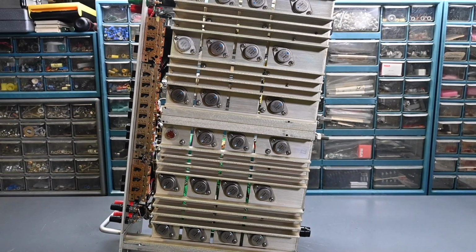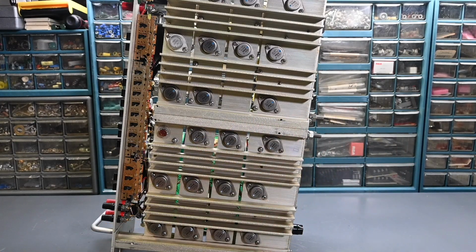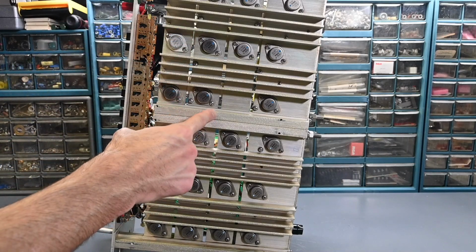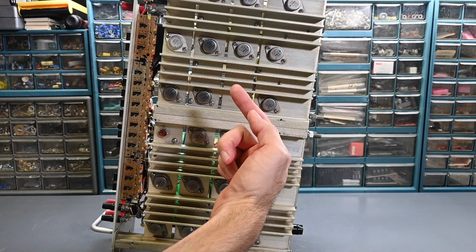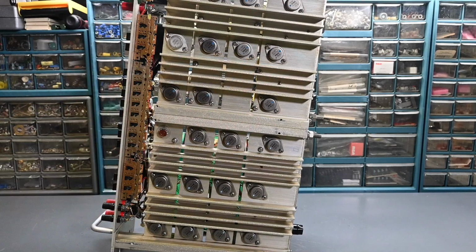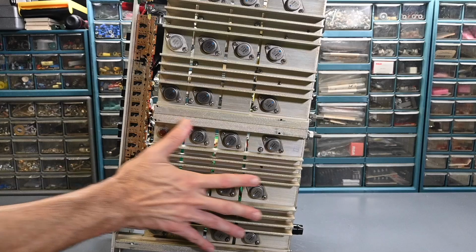I just want to show you one other thing right here. I mentioned that the airflow goes in those vents on the back. So the way the cooling system on this works, you can see these slots through the heatsink. You can basically look through, see the slot right here, and all the other places, those long slots. Some of the air is blown in on the top of the instrument and comes through these slots, but remember this was covered, and then the air goes out the back. And then there's this long open area up here, so any air that doesn't get through these slots can come through in this area here and then makes a U-turn and goes through this direction here.